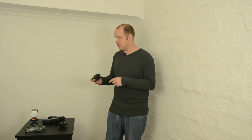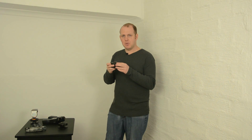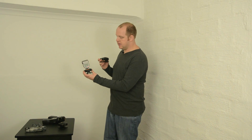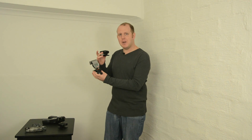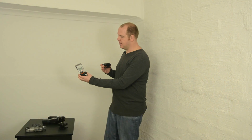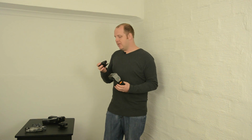Here's 32nd power. Now 32nd power wasn't available on the flash. There I've got 32nd power. Here I've got 64th power. There's 64th. Now just look at how many times, I don't know if it's going to pick up on the video. Maybe you can see the light right here. But just look how many times this thing is flashing at 64th power. Now remember, this flash couldn't do that. It wasn't the function of the flash. So if I go to 128th power, you can see I'm flashing it a lot and it's running like a dream. Okay, so there's also a low power mode on this where it's shooting at like 256 of its power.